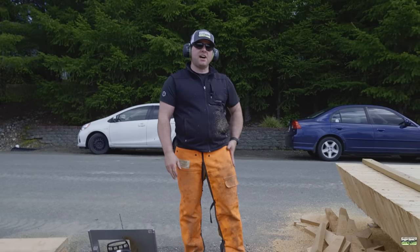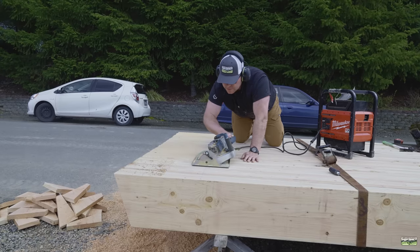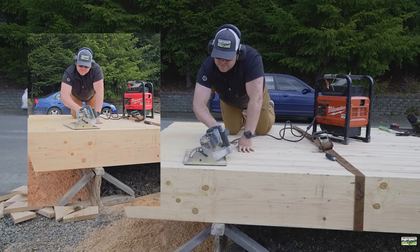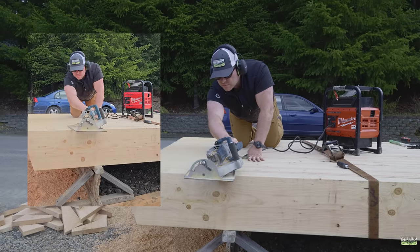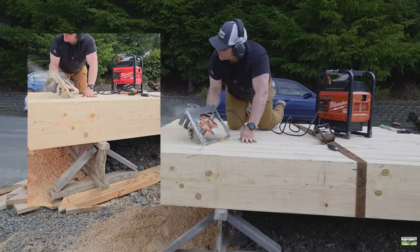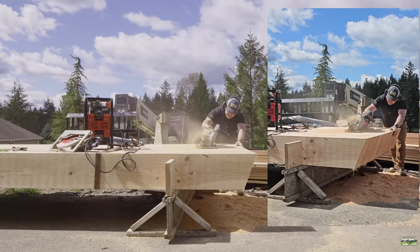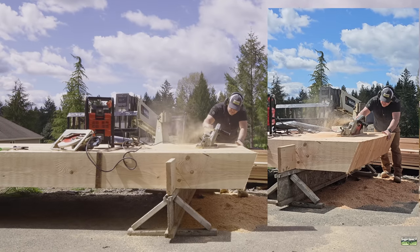You can see all the oil dripping. My thigh was against it to keep it to the base plate, and my job is to keep the saw pushed into the work. This is a Bigfoot — an old Bosch Bigfoot saw — 10-and-a-quarter-inch blade with a swing table, about 20 years old, set to 67.5 degrees. This cut is never fun. There is some working back and forth as you push through. The idea is you just aim straight and don't get hung up on following the line per se, because sometimes a rafter is a little lower or higher. Just try to cut straight.